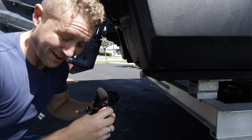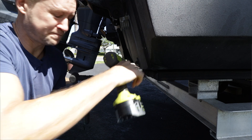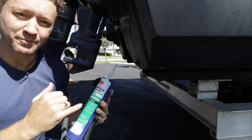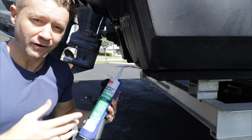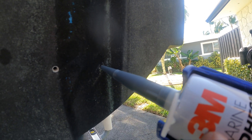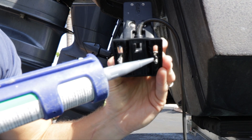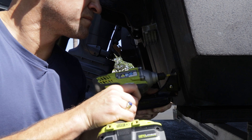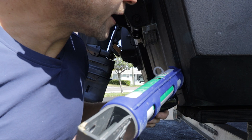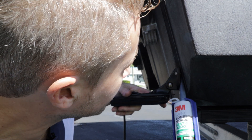A lot of fiberglass comes out of here. We're going to round it off to prevent cracking of the gel coat further. Now there's a little bit of discussion about which sealant to use. A lot of guys like to use the 5200, which is a much more permanent seal. I'm opting for the 4200 because it's still just as waterproof but it is workable later in case we need to remove or replace this mount — we're not grinding in there with tools. I'm going to place a little of this in the hole and then coat the screw, and squirt a healthy dab of 4200 behind here as well so that we're fully secure and waterproof.